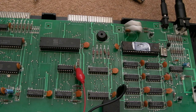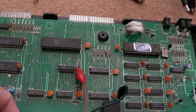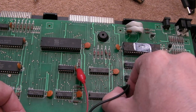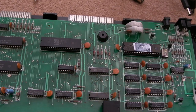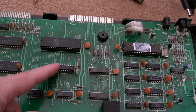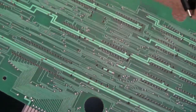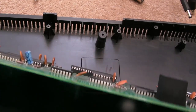So let's get this over to the mat. Let's get that chip off and swap it out. That is incredible. Seriously, I'm gobsmacked. Absolutely gobsmacked. All of the chips that are on here, the first one I logic probe and go, there's a problem there, and that happens to be the issue. That is just amazing. I've got a guardian angel, I'm sure. It's like whispering in the ear, telling me what to look at. Anyway, yeah, let's get that off.